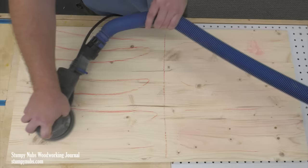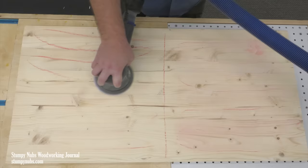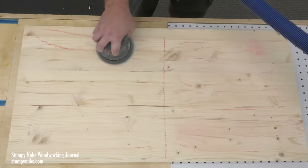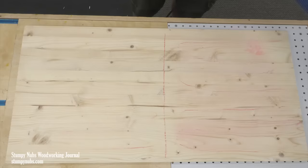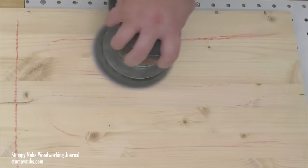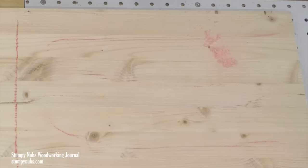You can immediately see the difference — the red wax isn't just getting lighter, it's disappearing. By the end it's gone entirely, except for the spot where I started, probably because I didn't get the sander completely flat on the panel as I began. The reason is clear from the pile of dust left behind: all that dust built up beneath the disc, clogged the grit, and kept half of it from touching the wood fibers.